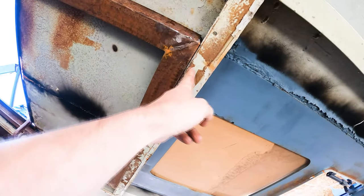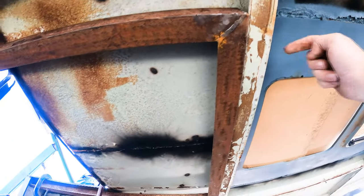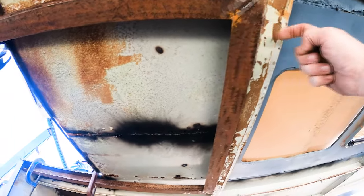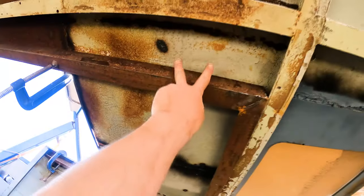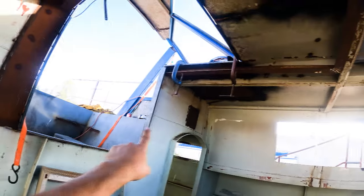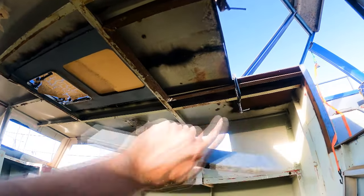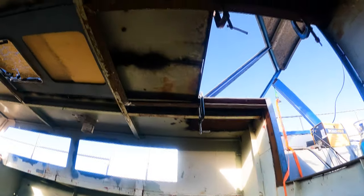And I won't have to weld any tabs in the back here because I'll just drill a hole through the back and the bolt will go through there and the tapped hole will be on this piece here and that will fasten up from the back. So I'll just put in three holes at the back, which means I'm just going to put a couple of brackets on this side. So I have some leftover material from these strips we just welded in, which is just here. I'm just going to cut this in half, then we'll end up drilling two holes, one there, and then two holes on this half. And then I'll weld in one there and one on that side, and the same on this side, one there and one there. And that will hold my companionway slide housing.